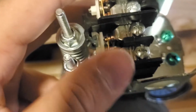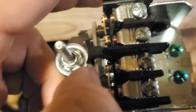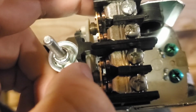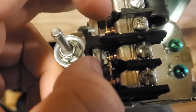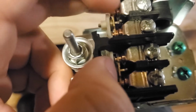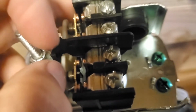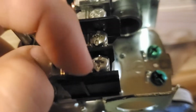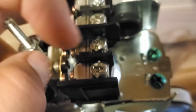And when the pressure reaches a certain point, it disconnects. So the pressure will then go down, and once it reaches a certain minimal pressure, it will reconnect, and it bridges between this terminal and this terminal. Since I only need to do it for one side, for the hot, I'm only just going to use these two terminals, so my hot will be coming in and going out.